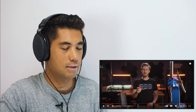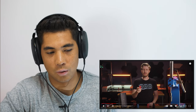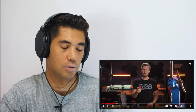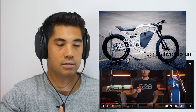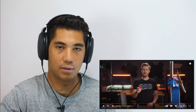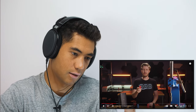Sometimes you think you have a great idea but you really don't, because as much as you can 3D print something, creating ideas on mass in a manufacturing sense with current technology is really really complicated. We got a comment asking if you can make organic designs — like those AI drone designs — in injection molds. The answer is no. Although AI can produce a more aerodynamic or stronger shape, there's no way to injection mold them, so you can't build a company off something you can't produce.